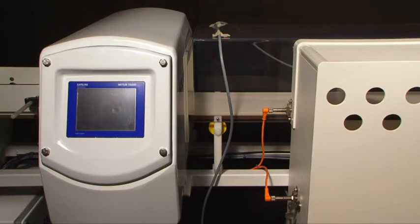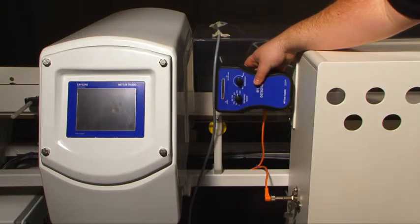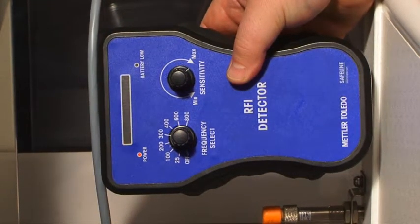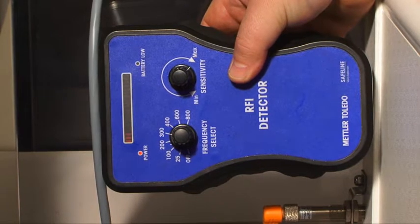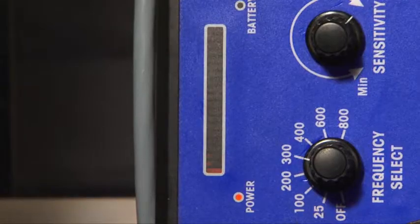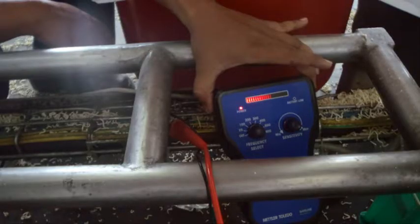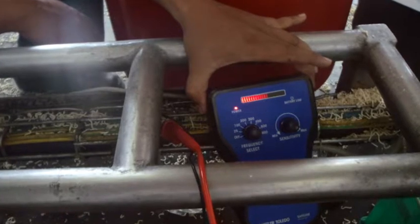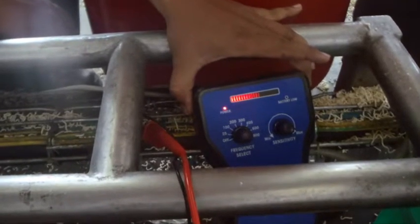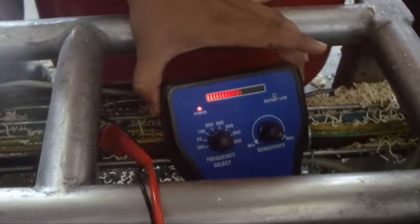When the detector is off, move the sniffer around the detector to see if a signal is present. You may need to increase the sensitivity of the sniffer to see a problem. In this case, you can clearly see that the unscreened cable is emitting a signal that is affecting the detector. In real applications, this may not be so easy — it may be necessary to walk around the detector system, checking all cables close by.